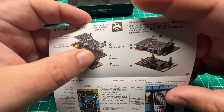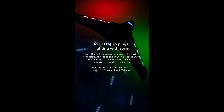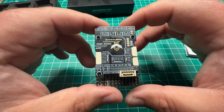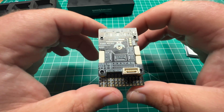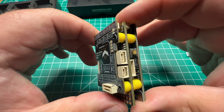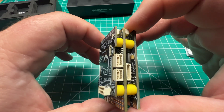The micro SD card slot is on the middle board — you can see it right here. You have four LED output plugs, so you can control four sets of LEDs without buying a separate controller board. It does have 5-volt, 9-volt, and 12-volt BECs on board, so you can power various accessories. Up to 11 PWM outputs for motors and servos.